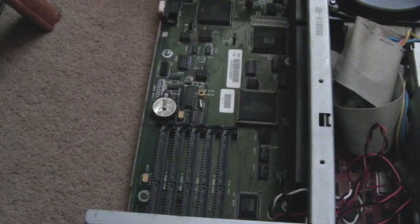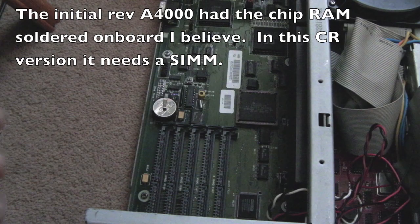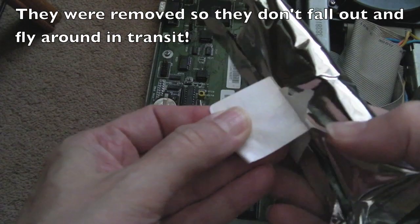So, I'll unscrew the lid and we'll fit that memory. So, I undid the two screws at the back. If we just slide this back and upwards, we can lift that out of the way. Yeah, there's no memory on board, is there? So we're going to get a green screen, unless there's some RAM on there, I'm pretty sure. It's curious as to why he's taken the memory modules out. That might be just to protect them a little bit, if there is still some corrosion around there.